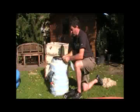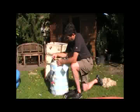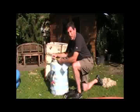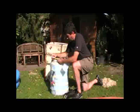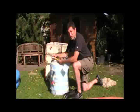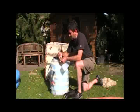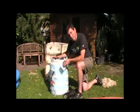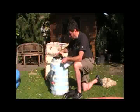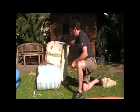So we are going to use 8-centimeter strips on this tank. That seems like it'll work out — we normally use 10 centimeters for the 200-liter barrels, but 8 centimeters for the 60-liter barrel seems right without doing too much cutting. I don't want to make them too small — even though that might be more efficient, it would take a lot more time. So: 8-centimeter strips, and since it's 126.5 centimeters, the calculator says 126.5 divided by 8 is 15.8 — roughly 16 strips to cut out of this to make our system.